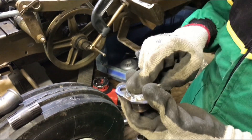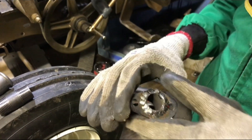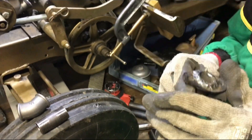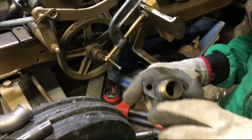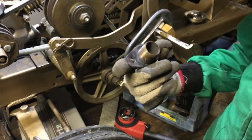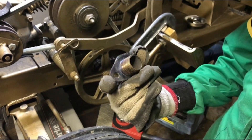We wanted a bit of threaded pipe on our manifold so we've cut one of these joiners in half. We put a taper on the inside of our manifold and Dad carefully tacked it all the way around, being careful not to warp it. The reason why we're doing this on the inside rather than welding on the outside is because these holes are very close to the pipe and we're not sure if we'll actually be able to get the nuts on.